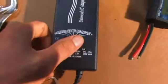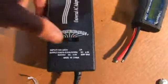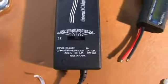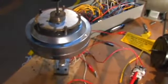And you can switch between different DC voltages. So this just plugs into your wall. It's used to charge computers. By the way, don't run out and take your AC alternator and hook it up to a computer or something like that. I'm not telling you to do that if you destroy your computer for whatever reasons. I haven't totally tested this yet, but I just want to show you these charging batteries, because this is a very simple way. If you have a high voltage alternator like this that has a lower current, you can actually run these off of them.